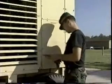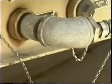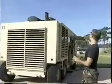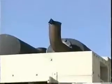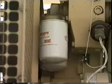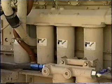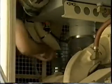Primarily, the operator should check the security of items and look for signs of leakage and damage. One item typically overlooked is the exhaust system rain cap. Failure to ensure it closes could result in the muffler filling up with water and causing quite a mess when the engine is restarted. Specific items to be checked for leaks include the water conditioner filters and the oil and bypass filters. Don't forget to include the associated water hoses and oil lines.